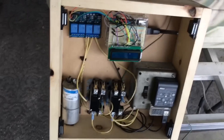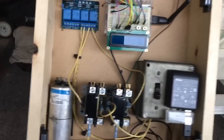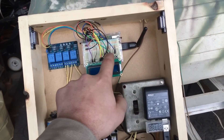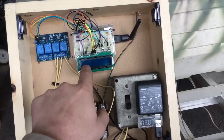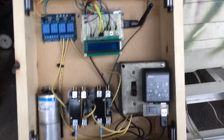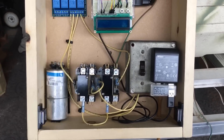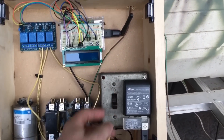I just built this wooden box to hold all the electrical components for the machine. We have our Pi with our breadboard that was glued to it. Then we have our LCD printout and a four-channel SainSmart relay bus that's controlling the two contactors to pull in the motor forward and reverse, along with the capacitor starts for that. Over here we just have our control center with a power disconnect.